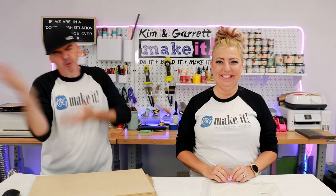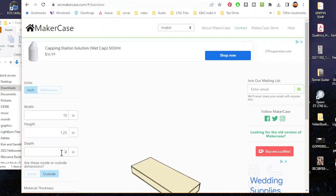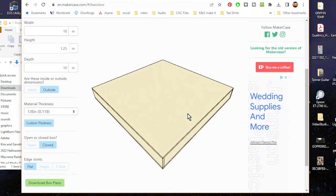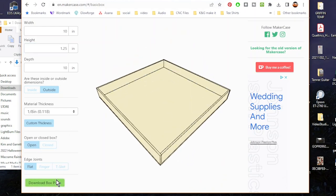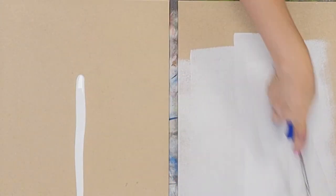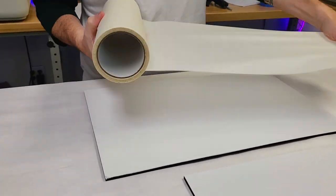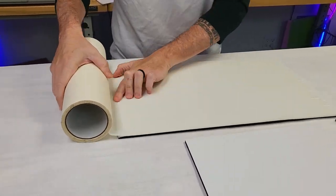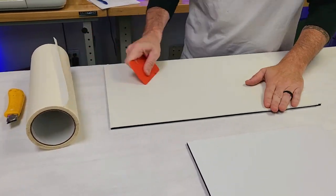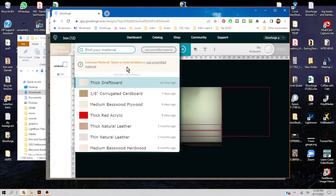Step two: we're going to cut our box. We're going to take that quarter inch MDF over to the Glowforge and cut it out. But first we're going to stop by MakerCase.com — this is where we go to make all of our frames and boxes. We're going to make a 10 inch by 10 inch by one and a quarter inch deep box, export it as an SVG, and import it right into our Glowforge app. Before we cut our board we're going to paint and mask it. We'll paint it white because it's easier to paint black over white, then mask it, cut and score some lines, remove only the tape we want for the black areas, and paint over that. To make our cuts in the Glowforge I'm going to use the thick draft board settings.